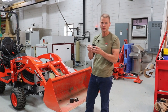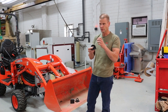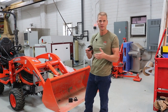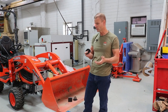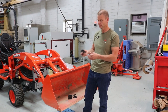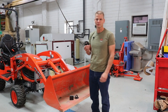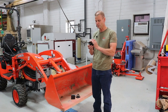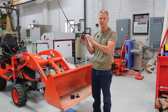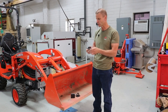They'll handle anything the BX can shove at it, because the other one was about a half inch wide. It was a weld-on hook with a 5,000 pound per hook rating, which is obviously you could dangle the tractor from the bucket and never even come close to overloading it. They were getting pretty expensive to buy, so I just went to an actual fabricated hook that copies the same profile of the original hook. So it's basically the same, but it's actually a little nicer to work with.